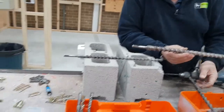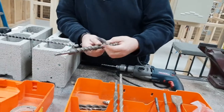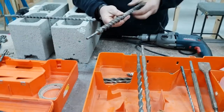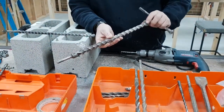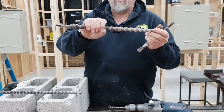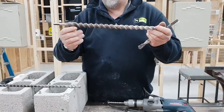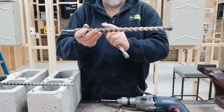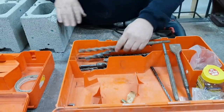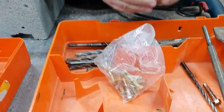You can get even longer bits but you're talking about very specialized drills that cost big money. We've also got shorter bits. Notice on this drill bit the flute is long and thin, whereas the other one is much more protruded. The outer part is designed to scrape to the width of the hole — so these outer flutes support the drill within the hole as it's drilling into concrete, keeping it straight.